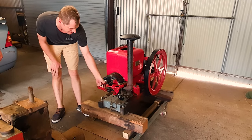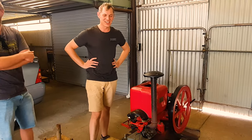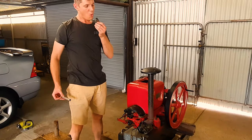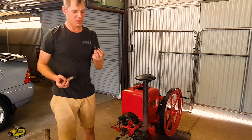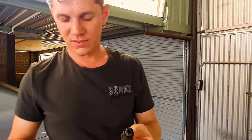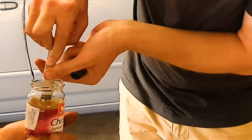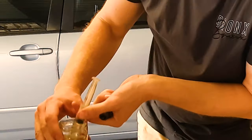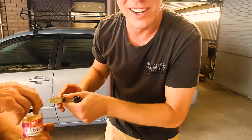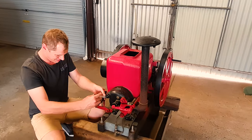Once it takes off it goes ten times faster than that — it'll flip them down. The reason I'm blowing the plug is because it's a little bit wet with fuel. If it's too wet it can blow out the ignition. So what we're going to do is drop a little bit more fuel from this beautiful jar from Shanker, which is Polish horseradish — ironic, because Grandad was Polish when he first got the Sundial.